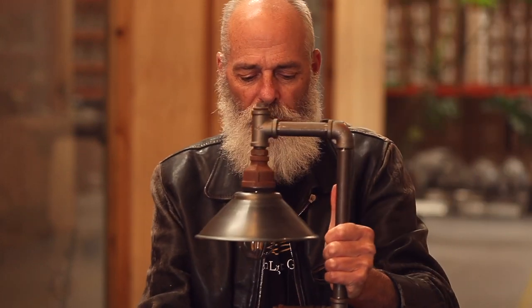We use these for situations where you're at home and you want to create your own DIY lamp for a bedroom or whatever, and you don't want to deal with electrical compliance or safety concerns. You wire up this little plug, connect it to a low voltage wall socket adapter, and then you're providing 12 volts through a regular lamp holder with regular cable. All you need then is a 12 volt globe.